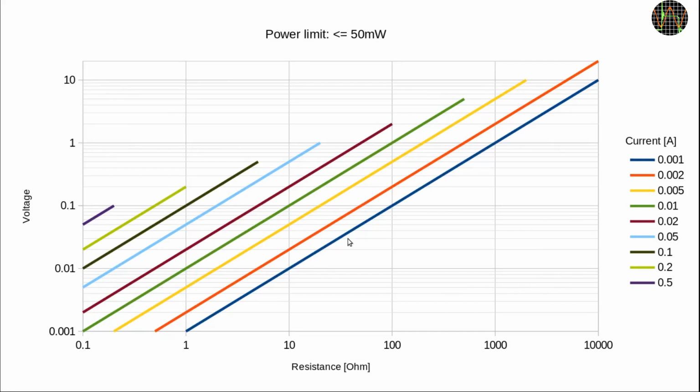Then, for more precision, you look up the approximate resistance and move up to find a more suitable current. If the resistance is somewhere between 1 and 10 ohm, you would use 10 and, going up, pick 50 milliamps and set the current limit to that. This will produce more accurate values, giving you a better result. It works reasonably well even for very low resistances.